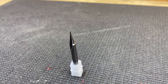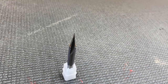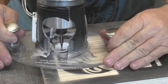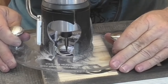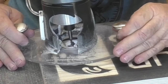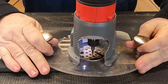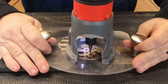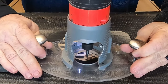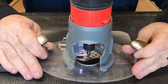Next is our carving liner. It's a detail-only bit — single flute with a really fine point. It's great for single-line artwork and anywhere you need a deep cut but can't be very wide. For new carvers asking what bits to start with, I recommend the profile, the 60-degree, and the 90-degree — you can do about 80% of your carving with those. But the carving liner is what I recommend buying next, because when it comes to fine detail there is no better bit. Even though it's single flute, it cuts like a dream, even through hardwoods like oak or maple.